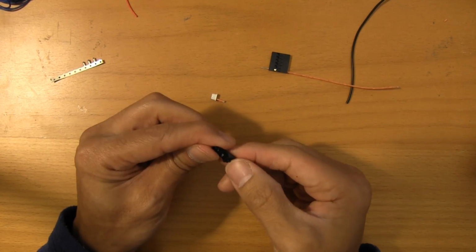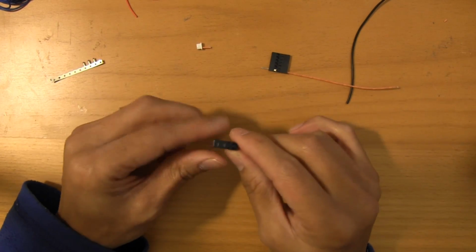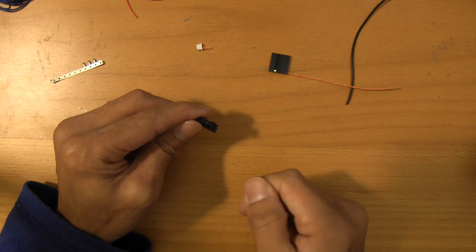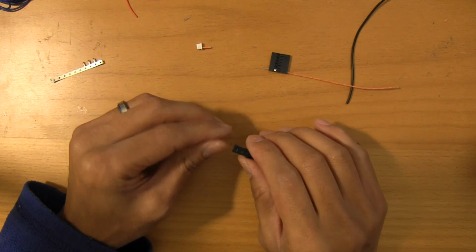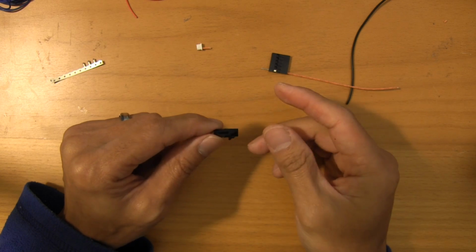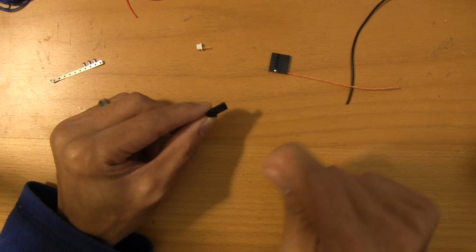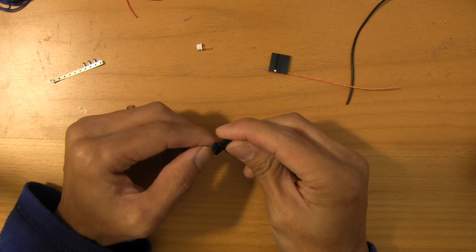And there's just one other tip that I wanted to mention, only because I do so much wiring, and this happened to me just as early as last night. When you get to the end of a crimping session, automatically say to yourself, I plugged in 2 wires wrong. And then it's your job for the next 2 to 3 minutes to go over your rig and make sure that you plugged everything in right. And don't ever think that you got it right, because I can guarantee you that at some point you will miss a wire, or you'll flip the orientation of something wrong. And when you've been doing this for about 2 or 3 hours at a time, it's very easy to reverse connections. So just stop, make an assumption that you got some wires wrong. Go in and double check your wiring before you apply power. Or if you have a current limited power supply, that's also great. But yeah, just a helpful tip there to save you from the magic smoke.